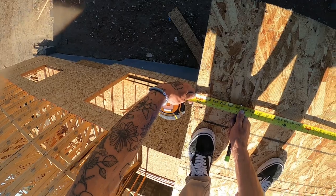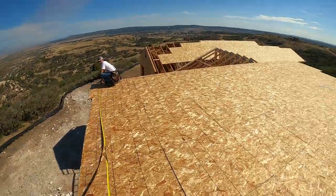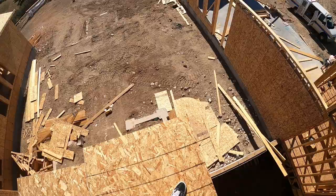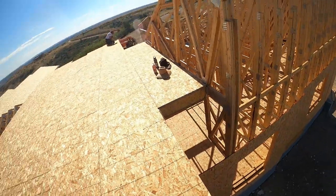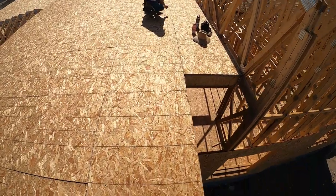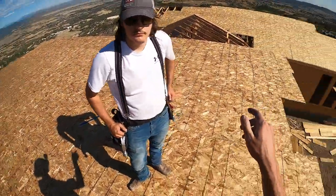My outside dimension is 20 foot, so I'm going to subtract down to 19 foot six and a half — I'll still mark 20 foot so we can snap that later and cut it. Now let's come all the way to the other side and mark the same thing. We are now coming through right here. How's it looking? Pretty good. Beautiful. So now we have two — or actually three — of our control marks.